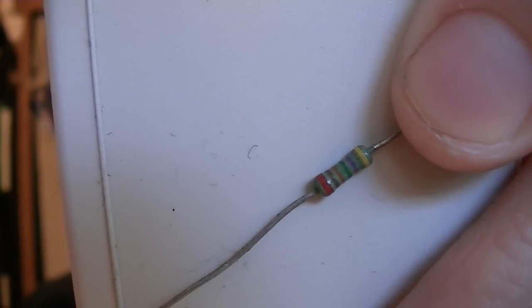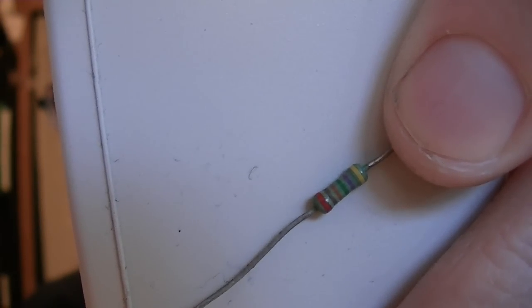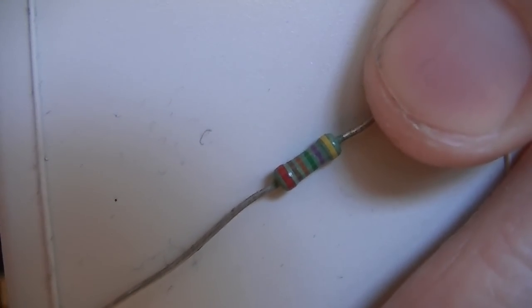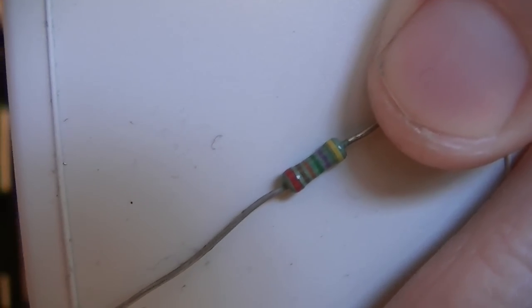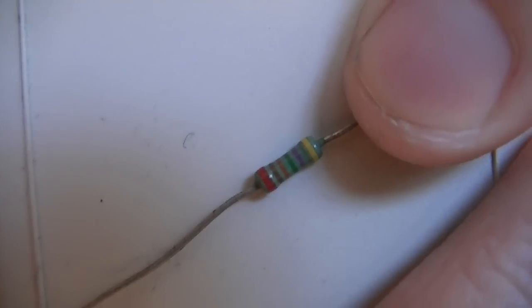There's one really big clue in those colors. But it's hard if you're a beginner and you don't know the colors well — there are some rules. This is a really strange resistor. It's weird when you see resistors like this. Usually the way you read them is you look for a gold or a silver, because you know immediately that's the tolerance. But there are a whole bunch of other tolerance color bands. That's how I always orient myself — for like a really simple 1K resistor.